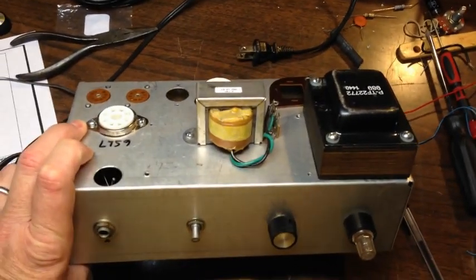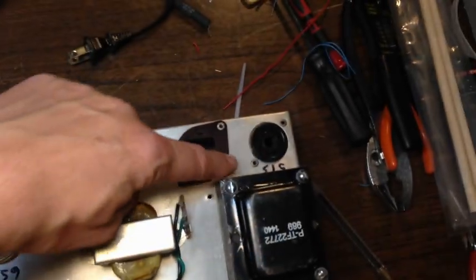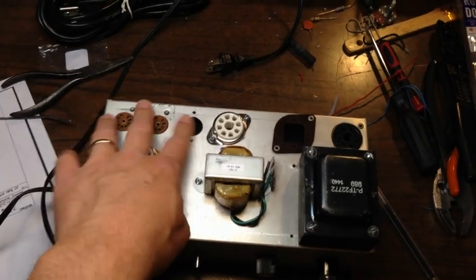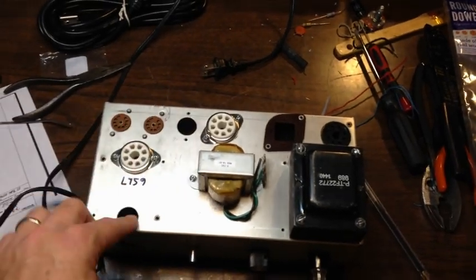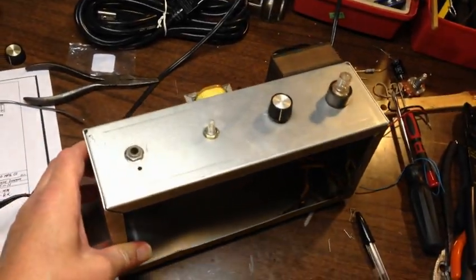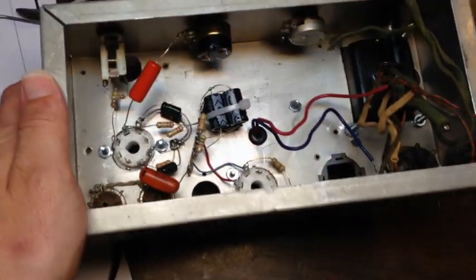You can see what I've got going here — this is basically going to be a 6SL7 preamp tube into a 6V6 single-ended output with a 5Y3 rectifier back over here. I dug up these transformers that I already had in my transformer stash. This chassis was a used chassis that already had some extra holes in it — something I got in one of those big trades I posted about before.